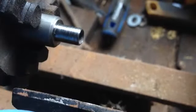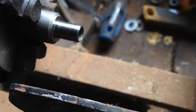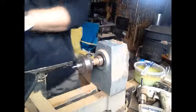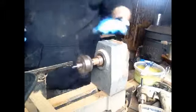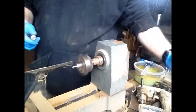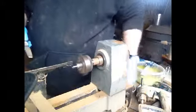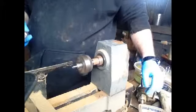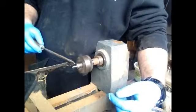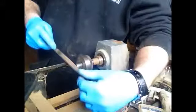I'm going to stick this into the die and see how it works, and I'll add that on the end of the video. So I tried that and it's still a little bit big. Actually, just as it's sized is about right, so this is for the plated or the jacketed bullets. All I really want is just that last two or three millimeters for the bell, and I've got to get rid of the rest here.